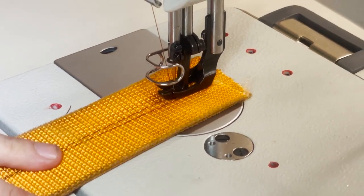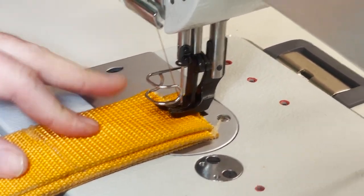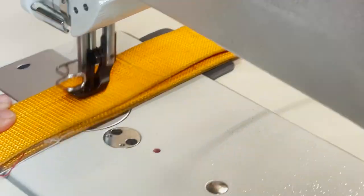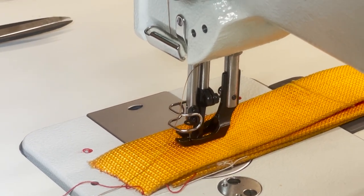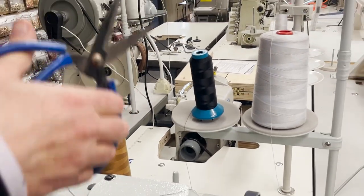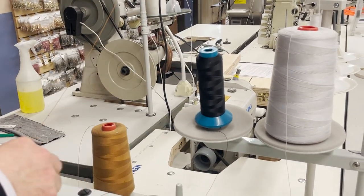Let's go reverse. Consew people should be very proud of this. When it gets really heavy, a lot of people crank it — and it will work. We broke the thread again, but breaking the thread is because the thread is not strong enough — it has nothing to do with the machine. So I'm going to go ahead and change to the T70 thread that I have.